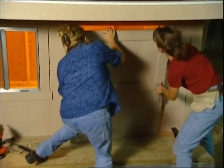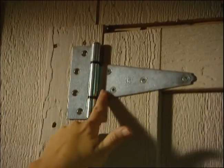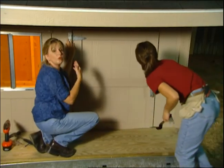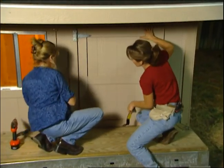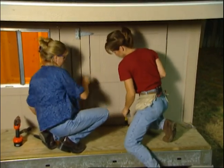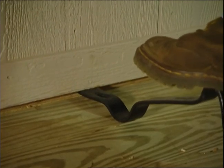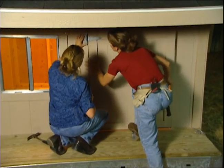We're down to our last step — we're ready to hang the door. There are several different hardware packages available with this kit, so you can choose whichever one you want to get the look you want for your playhouse. Because this door is so heavy and hard to hold into place, I'm going to use a crowbar and put it underneath the door, then step on it to lift the door up so I can hold it square with both hands. I'm going to screw the hinges into the trim using a drill.